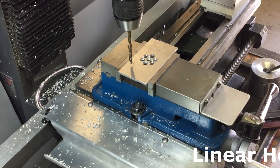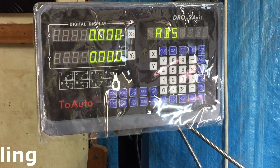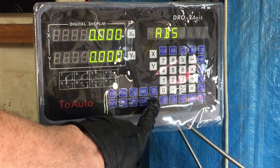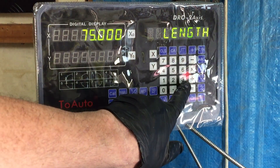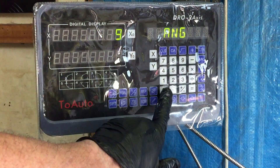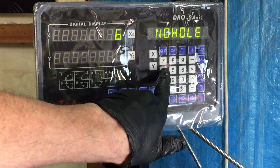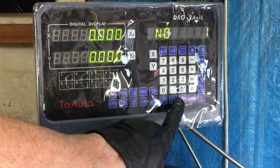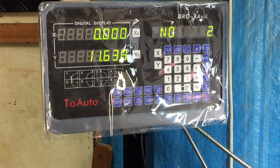The next thing to try is to drill a line of holes. I've positioned my drill where I'm going to start and zeroed it, then pressed the tool button for linear drilling. I put in the length — 35mm long — tapping enter every time. The angle is going to be 90 degrees, so it's from back to front. Number of holes — four in that length. Now it tells me where number one is, which is at the zero position, so I'll drill that and then go down arrow for number two, which tells me the position for that hole. This all looks pretty straightforward.